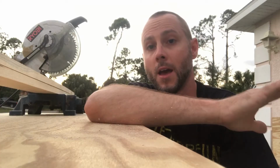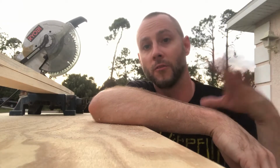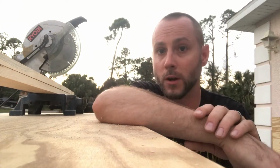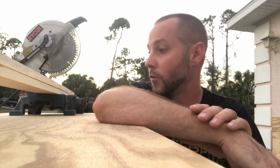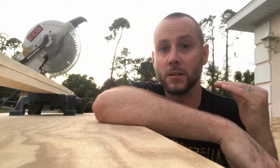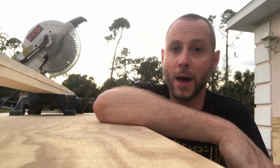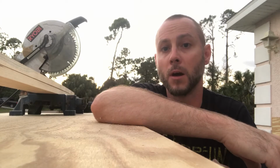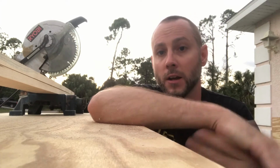Night 1, I'm going to cut all the trim boards that make the frame, basically the casing for the window covering, which then I'm going to lay the plywood over the top of and screw and glue to the frame. And then I flip it upside down on its face on the ground, and I'll cut sheets of wood and put them inside of it with caulking.